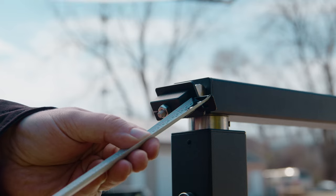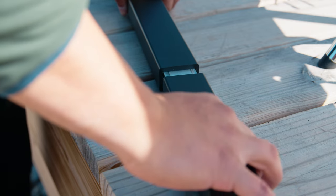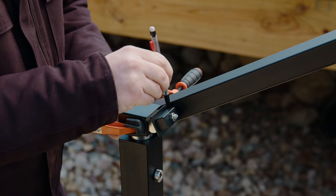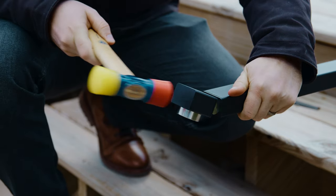To get the length of our handrail, we'll measure from the inside rim of each exposed hinge plug and cut a piece to this length. If necessary, we'd use a fixed straight spline to join multiple pieces together until we meet the desired length. If your stair section is shorter than the length of your handrail piece, you can even just set the handrail on the hinges and scribe your cut with a pencil. When our railing is fully assembled, the tension from the cables will hold all of this together with no problems at all. That said, you can always install a few set screws for peace of mind — or skip ahead to the timestamp in the video if you don't want to worry about this.